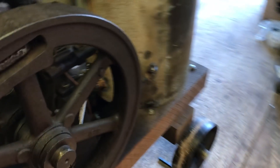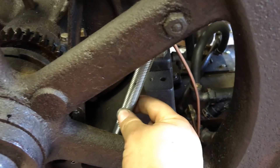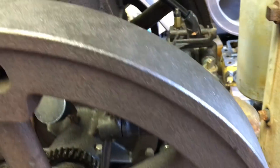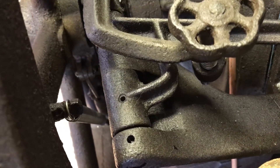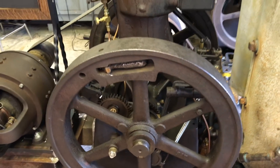The one thing I did do was put a different spring on the governor. I did have some trouble getting the governor adjusted, so I'm going to have to readjust it now that I've got that long spring on there. That'll be a little bit of trial and error, but I should get it straightened out.